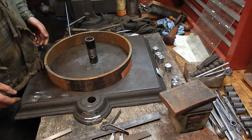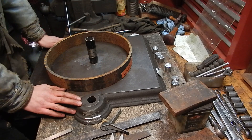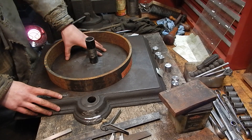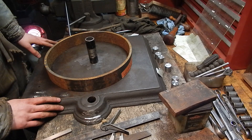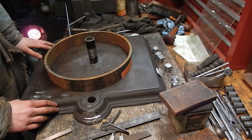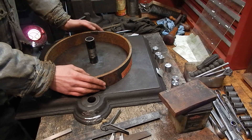You've got to use what you've got, and what I had was this iron plate. You need to find something big, flat, metal — nice and rigid. This is some cast iron plate of some sort. It has a ground surface on it, so I can be relatively certain it's flat, and I'm working off this surface to build my wheel and make sure everything is aligned and square.